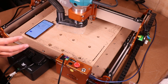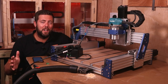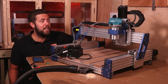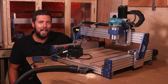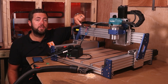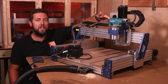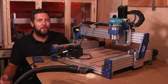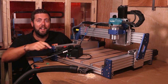So there you have it — you can see how quick it is to set up and make it all work. As mentioned earlier, it does not need to be a Fox Alien machine. As long as your CNC machine has some sort of spindle cable or spindle output from the control box, we can make this relay work. In this scenario I've just connected to the existing spade connectors. Usually you would remove the entire spindle cable out of the drag chain just to clean up the wiring, but this is obviously for a demonstration. We can now see this work — the router will kick in and it'll extract the dust.